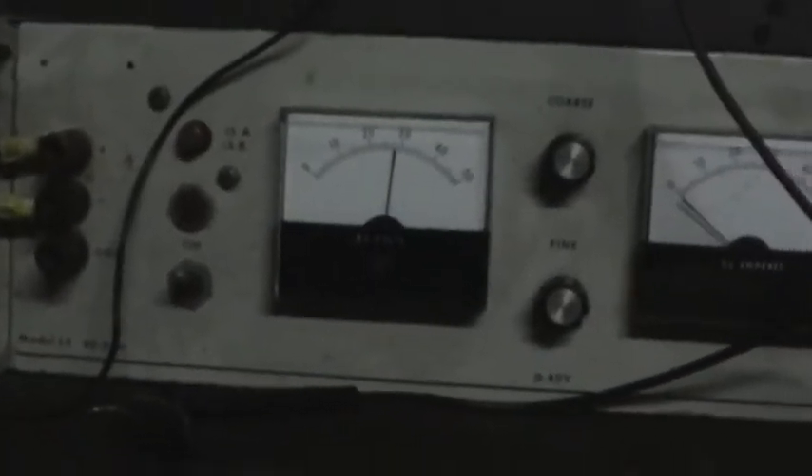I'm now changing my focus away from the UPS being the problem to perhaps the batteries being the problem. What I've got here is a simulation of the charging going on. I've got the batteries wired in series, so I should have 24 volts across them, going through a very robust 0-40 volt, 0-25 amp power supply. Right now I've got the set point exactly like it was in the UPS: 27.94 volts.